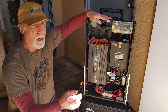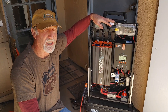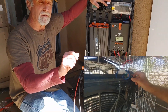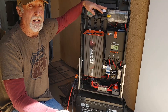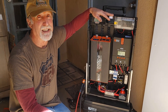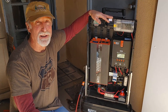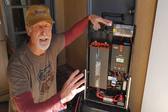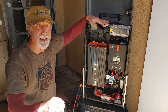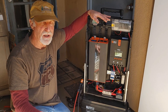I'm going to put a link to another video where I set up solar-powered fans for our dog kennels — basically just running off a solar panel with no battery at all. Speed controllers control the voltage going to 12-volt radiator fans. The nice thing is we can leave for work, and once the sun comes up high enough the fans start moving, and when the sun goes down they stop. Same scenario works for a greenhouse — once the sun is high enough, it starts moving air through, which prevents overheating.